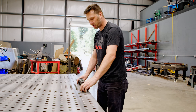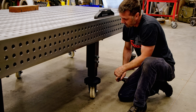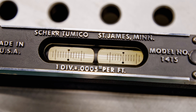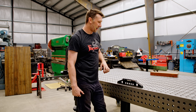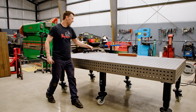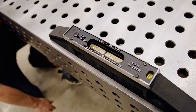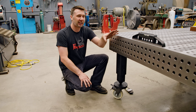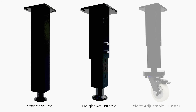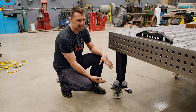It says this leg needs to come down some more, so let's lower it. The middle legs I don't touch until the very end. As I lower the leg we should start to see it come into view — we want that bubble to be in the center. I've got the bubble perfectly in the middle. Now we need to get the tilt — same process. This leg needs to go down. I'll give you guys a disclaimer: if you're trying to achieve an accurate table level like this with a machinist's level and want the table as flat as possible, I would ditch the wheels and go with a fixed leg with a standard foot. That's going to give you the best ability to level it accurately, but I'm keeping the wheels on just for this demonstration.